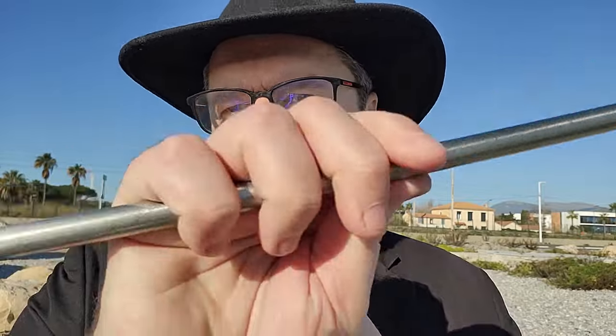Of course, you can also use the coil with a long wire that you can just attach here, or a 7-8 meter wire up a mast, and have much better efficiency that way. You don't have to use a whip necessarily, you have the choice between the two, a whip or a wire. And lastly, I am going to use the spike from Chameleon here, just to put the coil into the ground, or I have some kind of support over there where the trash cans are. And that's it, you just put it in the ground.